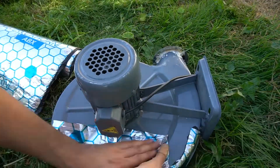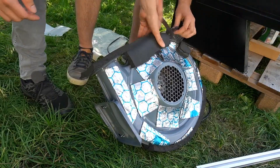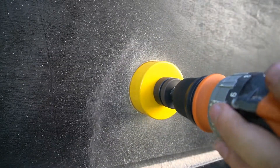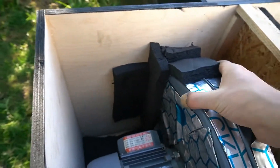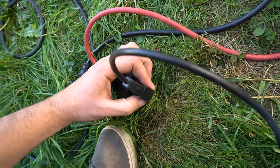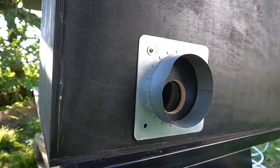After I covered basically the whole blower, I also applied self-adhesive foam to it. The idea is that the blower case will be clamped into the case just by the foam, which will help to completely isolate it from any motor vibrations and also create a seal on the output of the blower. Now that the motor is prepared, let's mount it in the box. This is very easy — one, cut a hole in the box; two, put a junk in that box. Anyway, I put the motor into the box and used these strips of foam to hold the motor in place. It looks a bit sketchy, but it just works fine — there's no vibration on the case, very little vibration on the motor. Then I mounted the flange for the tube and sealed it with silicone.